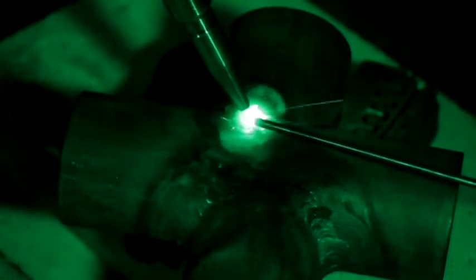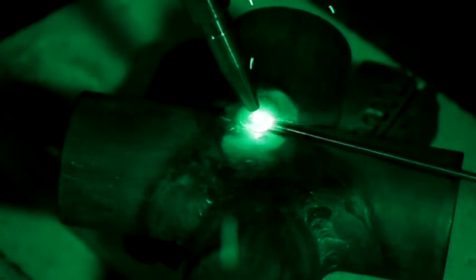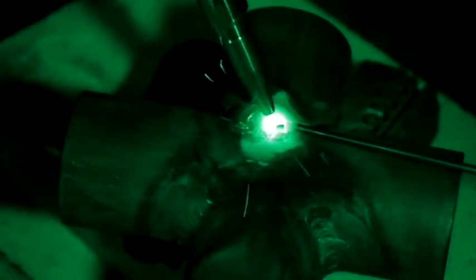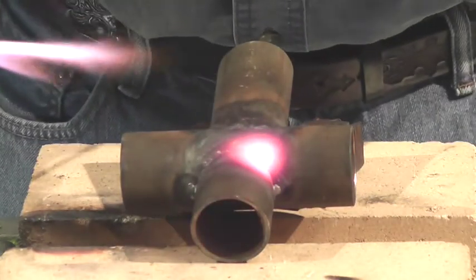You're just working that puddle — a lot of you TIG welders, it's just like working that cup. You can actually hold the rod down in there, and for guys just getting started, just work that circular motion around the rod. It's a little bit easier — remember that flame is very concentrated, so tie it in, work it all the way around, then come back and post-heat it. That's all you've got to do.